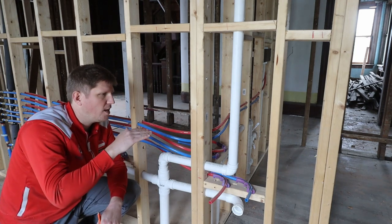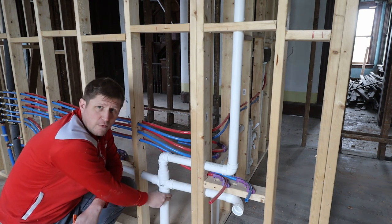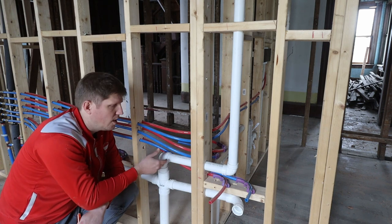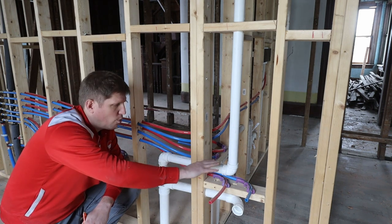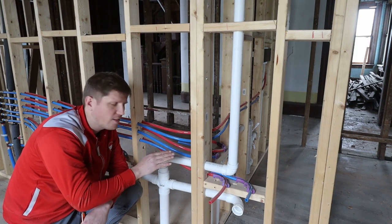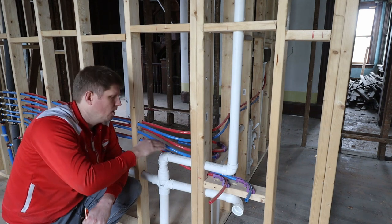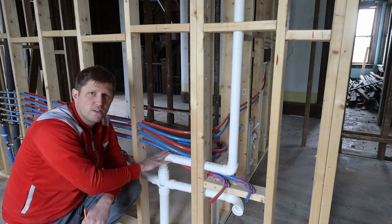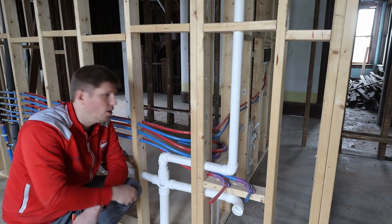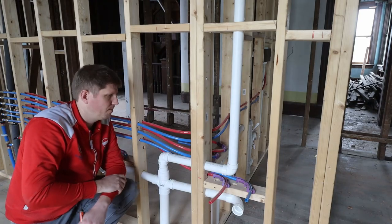So therefore, in case it overflows, it plugs right here, right underneath, and the vent also starts filling, it wouldn't have a horizontal line where debris can then fill up and then clog the vent. So therefore, the vent should always be vertical until the same level as the basin or whatever appliance that you're using has its water level.